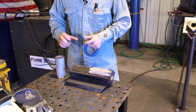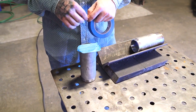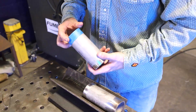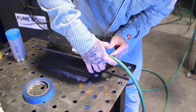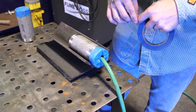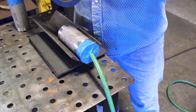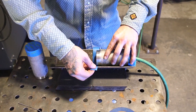First thing I'm going to do is come back here and tape up the backside. For this pipe, we're going to do three penetrated tacks, so I need to purge it — that's where we put the tape on. There are lots of options when it comes to purge tape. The most common is just masking tape, but if you're on a job where they provide good quality 3M purge tape, it makes a really big difference — it's strong, heat resistant, and the glue won't burn up. Your seal on your purge is really important because if it's not an airtight seal, it might create an effect where it sucks oxygen in as it's pushing the argon out, so you're never going to get a really good purge. Make sure you seal up the end where you have your purge line.